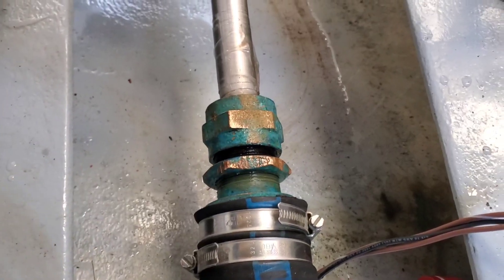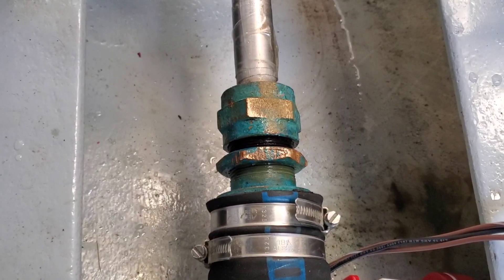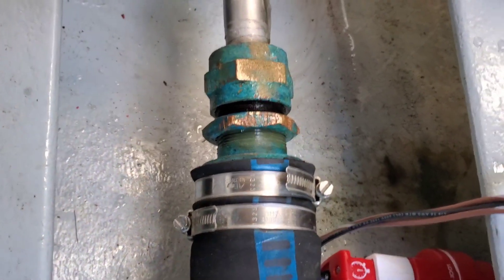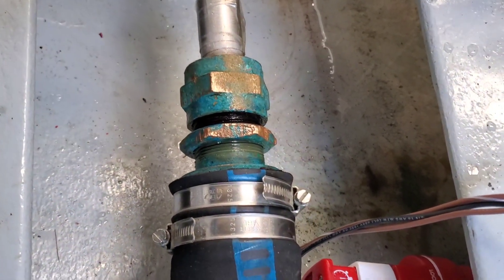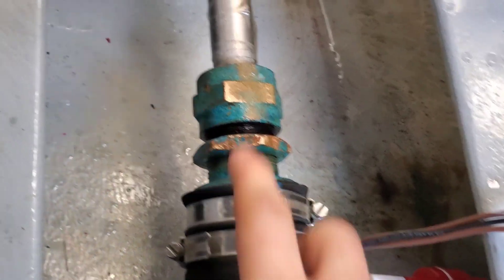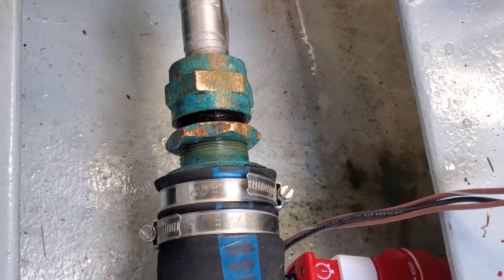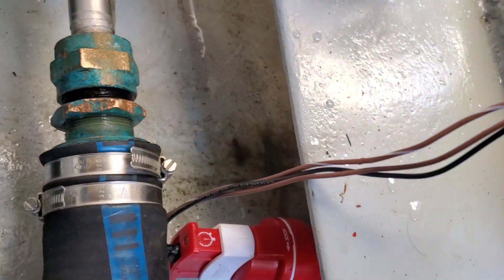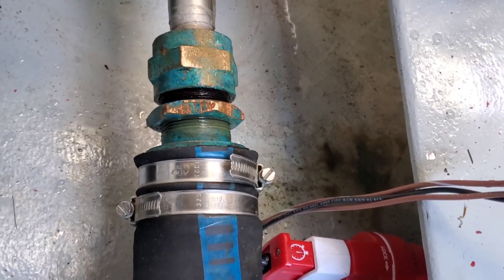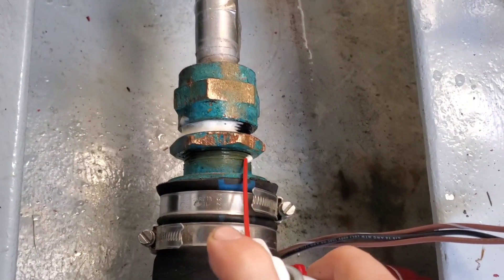It is actually day two and I do have the motors in place hiding in their IKEA boxes. But I really needed to tend to this packing nut, especially on the port side — it was just dripping way too much. Last night I was livid trying to get this thing loose and only managed to get the bottom one loose; could not get the top one loose at all, no matter how much I swore at it. So I went out and got some Deep Creep by Seafoam — not a paid sponsor, but it actually worked. I did a little shot up in the threads like so.